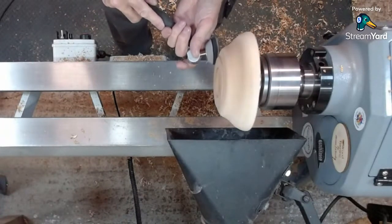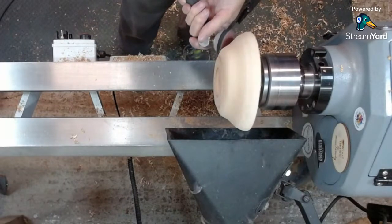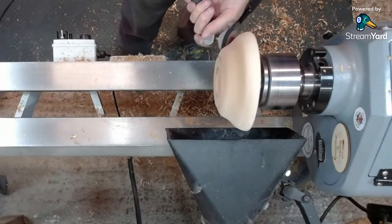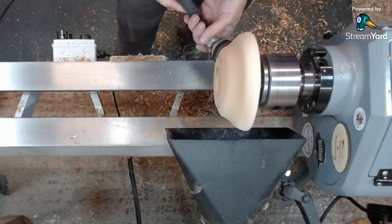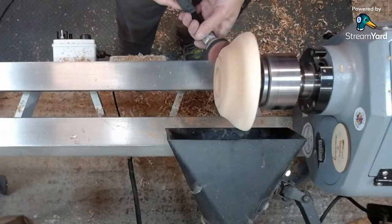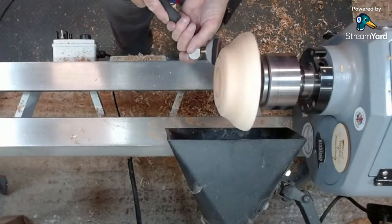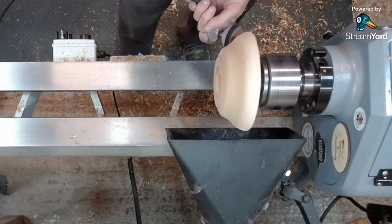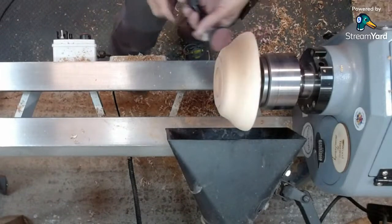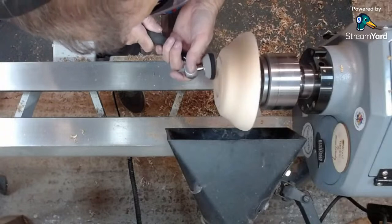There's a question for you, Terry. Oh, hello, Douglas. If we're buying a rough olive ash blank, how would you know without turning it? Well, you can tell by the end grain as it changes colour, and also you probably could tell from the flat surfaces, but the end grain's easier. Look at the end grain; you can see it's changing colour as it comes outwards. And if it's brown in the middle, you think, that's olive ash.